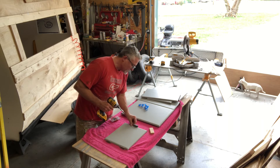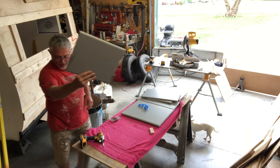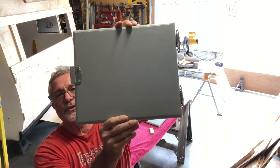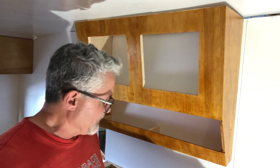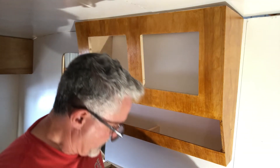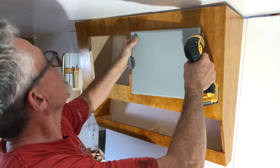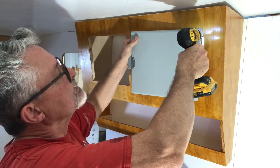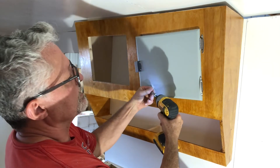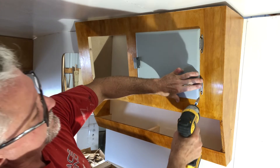These were the doors we're working on. One of the things I like to do is make myself a little spacer, and that way I can put that right down beside the hinge on both ends so they're equally spaced and it doesn't look wonky. I do it for all of them. Back to our cabinet — we're going with silver, and I've got my door put on. Remember we've only got a half inch on each side — that's how we designed it. Let's get this first one started, eyeball it, get about a half inch in on each side.